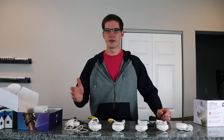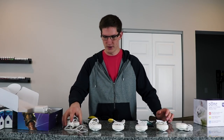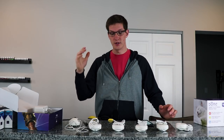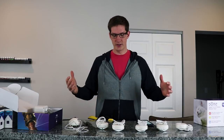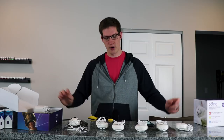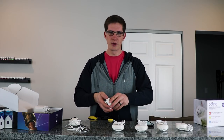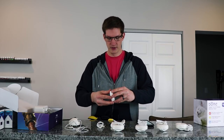What we're going to do is go ahead and get all these paired up in a centralized location — the hub is not far from us. They do recommend being within 10 feet of the hub to get them paired because they have a little less signal range during pairing, but after that you can move them as far away as you want within the Z-Wave Plus range.